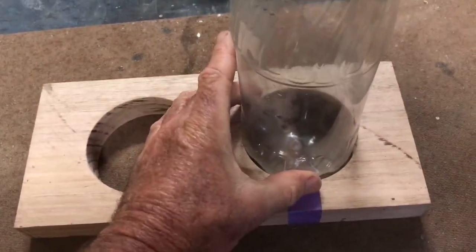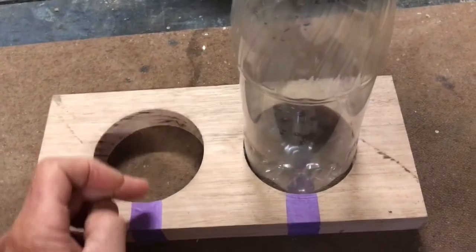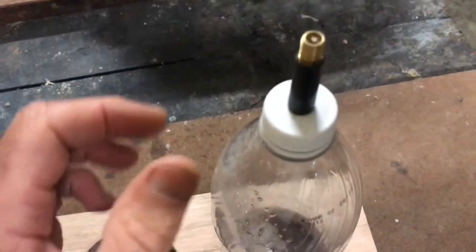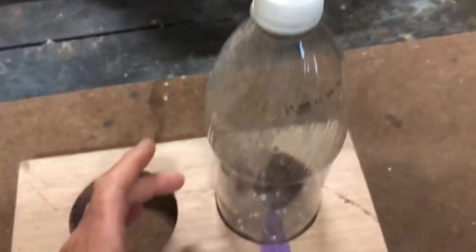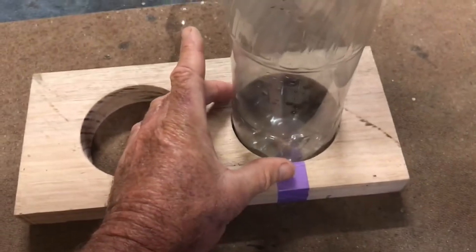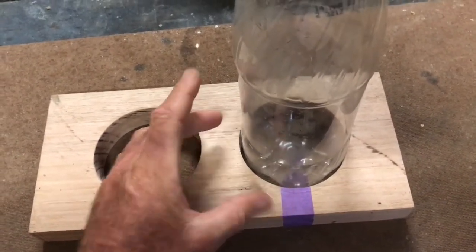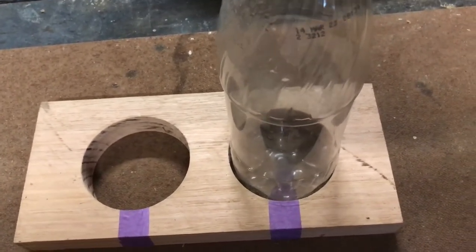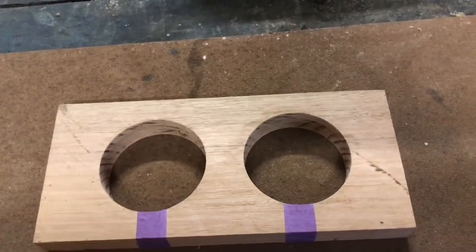I've designed it so that it's going to be a tight fit around the strip of timber that I place into the mold, but there's one slight improvement I've made as well. By putting a valve stem into the cap I'm actually able to put a little bit of air in, and that air expands the bottle slightly and it holds that timber veneer in place. It was just one of those ideas that came to me fairly quickly and the design works exceptionally well.